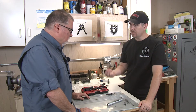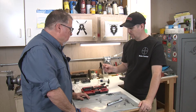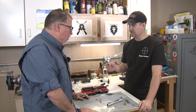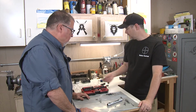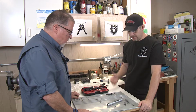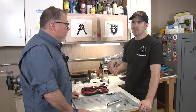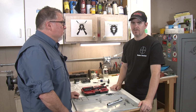These were usually machined from a solid piece, right? A solid component. When I start running into cast parts, and this is another one where the screws yielded before we even hit torque spec, and this one just keeps your gun from cycling. It kills your gun, keeps it from cycling, and like I say, this is one of those critical components. But we've been running into that, where you'll see things that are not built to spec.